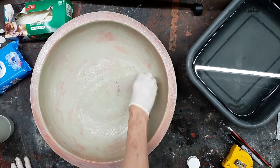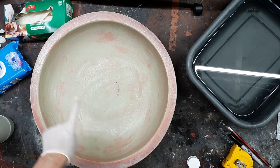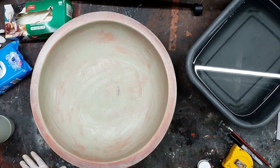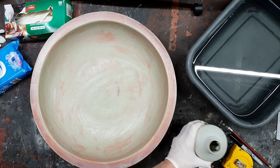Now, the beauty with the green Hydroban, it used to be black in our early days, is that you see the color it is now, that will dry probably half an hour or so, or an hour, depends on the weather, into a deeper olive color, and you know it's ready to go. We used to have to wait 24 hours between coats, but we don't now.